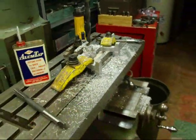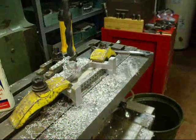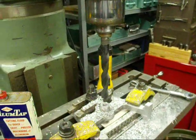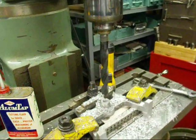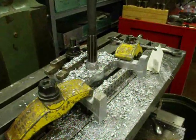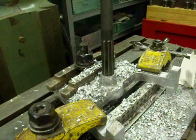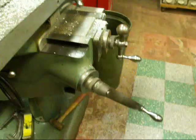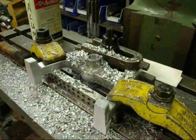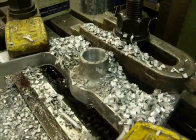I had to lower the table quite a bit now in order to do this. I am going to lock the spindle and feed the table up. I put the machine in back gears because we want to run this at a slower speed, and remember when you have got your mill in back gears that necessitates running the motor in reverse. Now for the final size, I am reaming 13 sixteenths — the machine is in back gears running at a slow speed and I am going to feed up with the knee crank. And now we have, hopefully, an accurately reamed hole, 13 sixteenths.